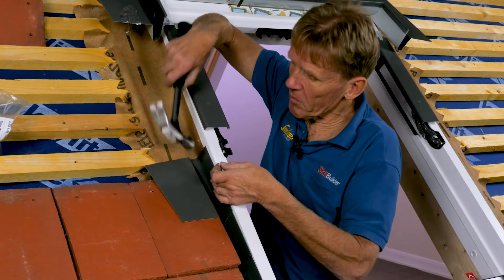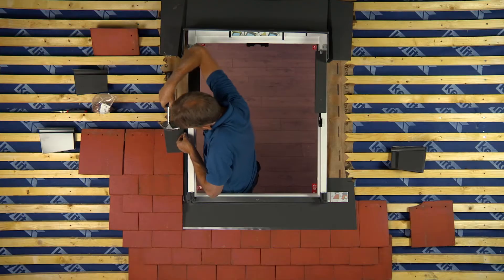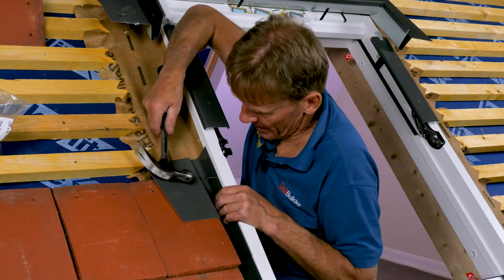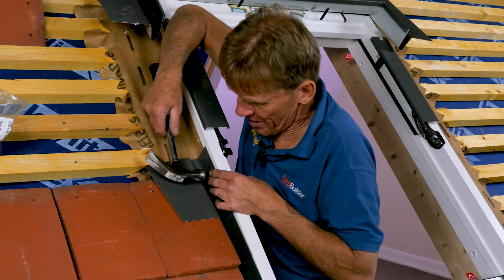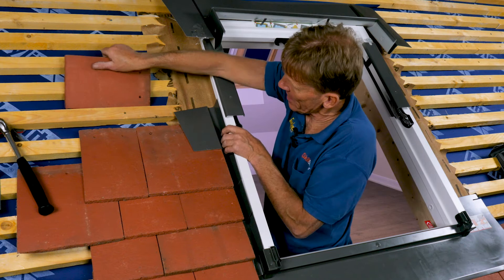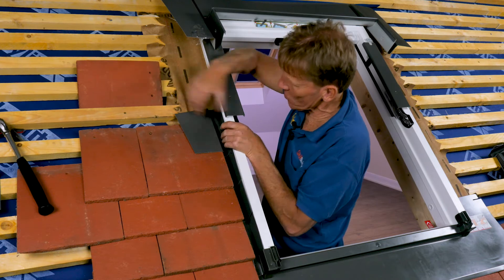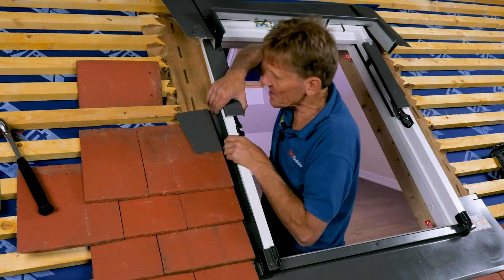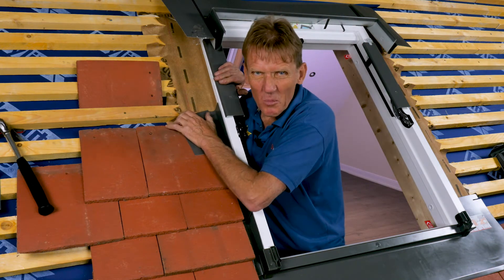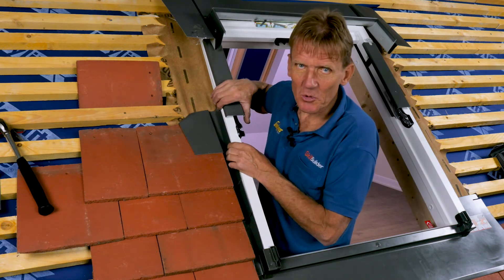When I come to do this soaker, I nail it down slightly because we don't want to clash with that hinge. The hinge is rebated and although it wouldn't do any damage, the wood will be a bit thinner at that point. Because we're still at the hinge point, I position the soaker where it needs to go, and since we're still at risk of nailing around that hinge, I just tuck the ear of the soaker over — that'll hold it and stop it slipping down. Quite honestly, I've seen roofs where every single soaker has been fixed like that; it doesn't do any harm.